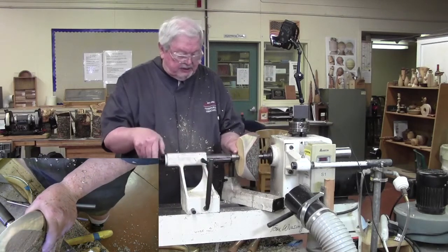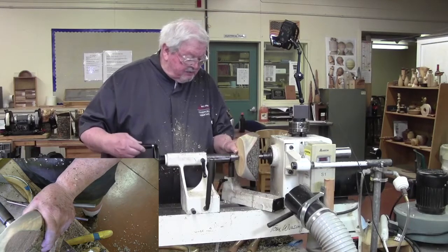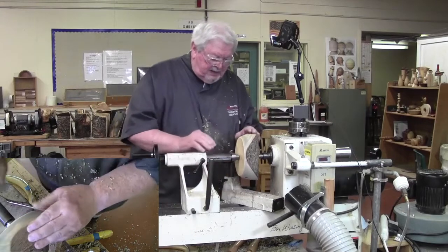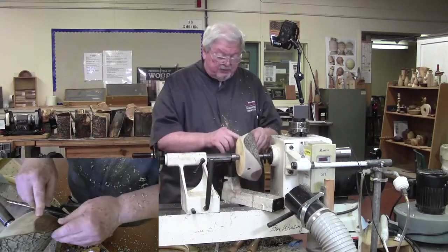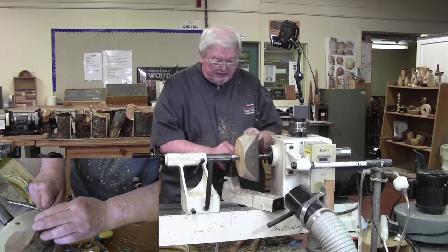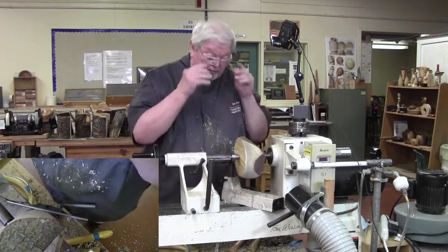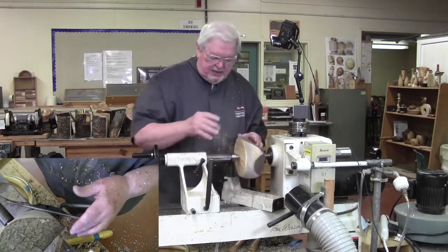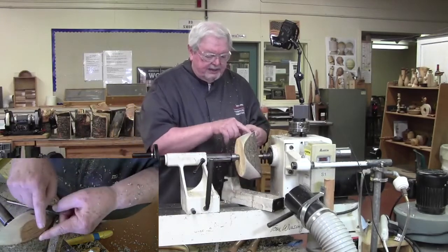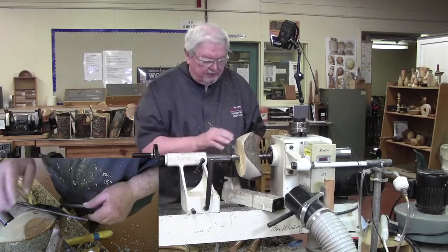So what I'm going to do is loosen the spur drive and move it slightly to the left. Now let's see how we're doing up here as we approach the wing. Cutting the bark there, and that alignment looks pretty doggone good because we set that up earlier from these two edges. So what I'm going to do is continue to bring this down and up until I hit bark and get the bottom shaped where I want. So more of the same.